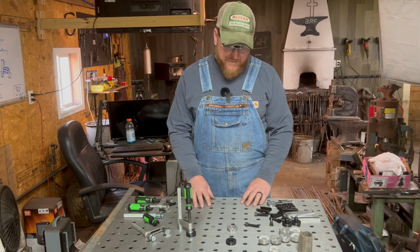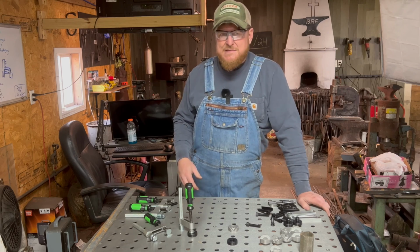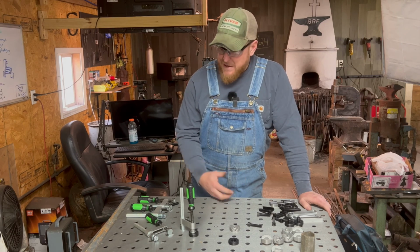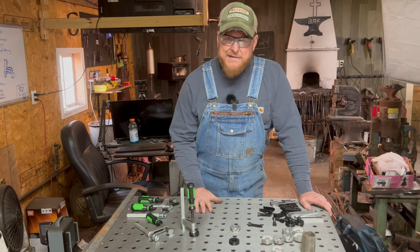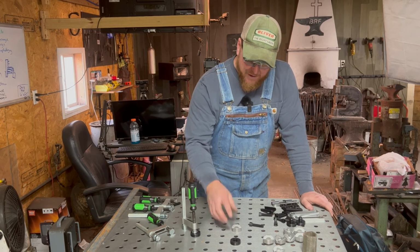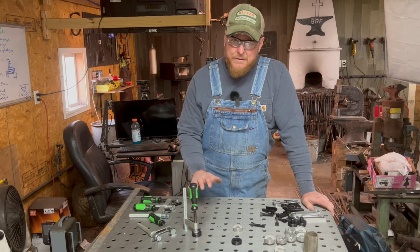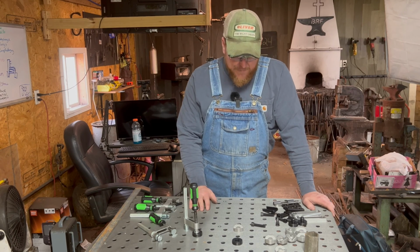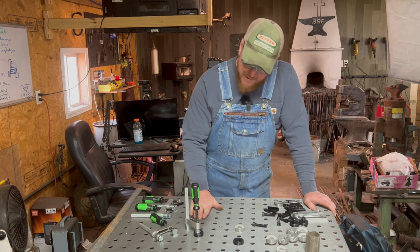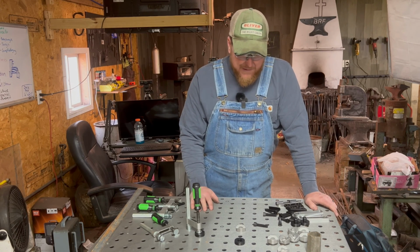And if you're disciplined enough with a table like this and not bring over the torch and the 8-pound sledge and mount a big vise to it and wrenching and cranking on it, this will do exactly what it's designed to do. It is not designed for beating and banging in high heat to go on the table. It's 1/4 inch thick. And with these fixtures, getting them up off the table and getting your work up off the table, I think, again, that's a phenomenal way to do things. If you look at all those that really honestly do fixturing the way it should be done, you get the work up off the table. And so that is going to be a big key. I think it'll help. You keep the surface clean, keep it free of spatter, and I think, again, it'll perform quite well.